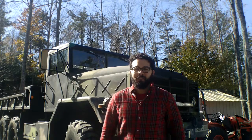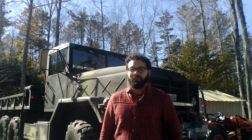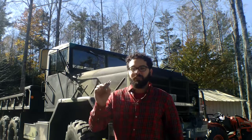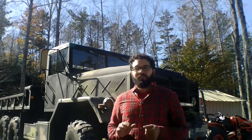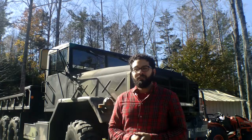Hello, this is Francesco from Super Rock Technologies. You may recognize me from other films such as Strain Without Distress and Digital Strain Gages. We are gathered here today to demonstrate just how simple it is to install one of our strain-based torque sensors for rotating shafts. It's all wireless, and the basic premise of our install is we use two studs welded to the shaft. You bolt down the module and it's ready to start taking wireless strain readings with our free software.